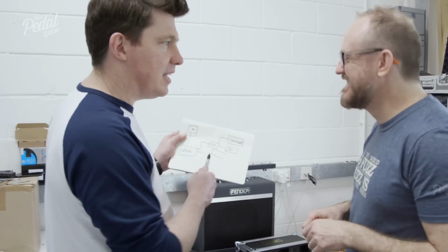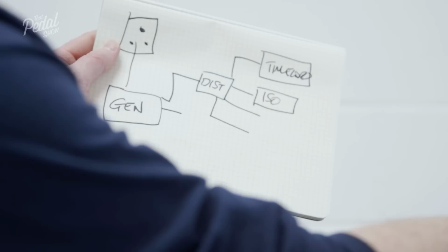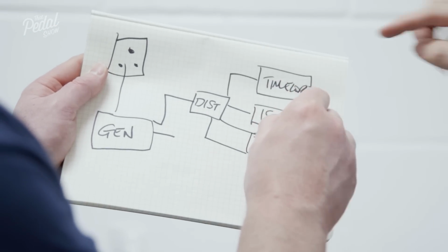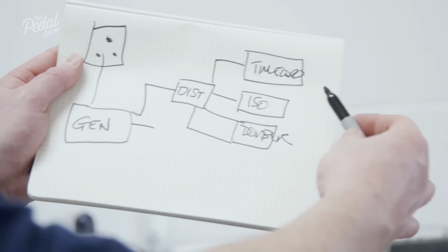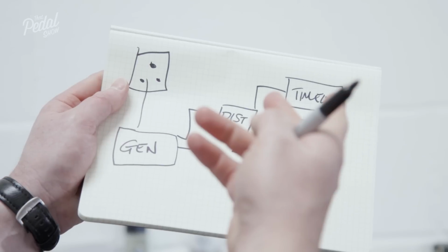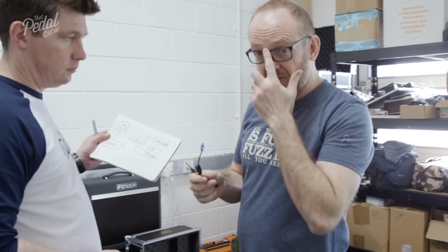So forget your fancy on-screen graphics. We have the medium of Sharpie. Let's say you've got over here somewhere your vintage Electro Harmonix Electric Mistress. What needs to go between the distributor and that to get to the Electric Mistress? So that's an 18 volt pedal. Yeah. So we need a doubler on that, and that doubles the voltage. Same sort of shape as the Time Lord, but that changes the 9 volt input to isolated 18 volts at the output. And so we could apply that theory to any other kind of pedal. Yeah, 9, 12, 15, 18, 24 volt. Polarity reverse. If you need a reverse polarity, you can get the little adapter that goes on the end. Asking about the Electric Mistress, that requires a mini jack. Yeah, a lot of the old Electro Harmonix pedals need that.